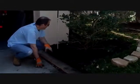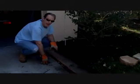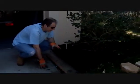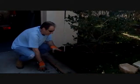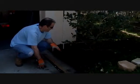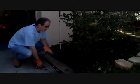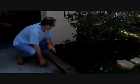Leveling off is the hardest part. You want to make sure the dirt underneath it is all compacted so that you don't have any more sinkage, so that your blocks will stay exactly where they are. So you want to have a nice level foundation and sturdy foundation. So you have to really pound it down. Usually I'll take just my boots and maybe jump up and down on the area, moving the dirt around.